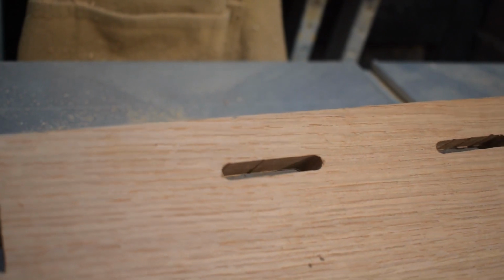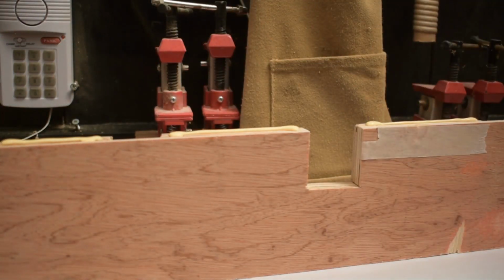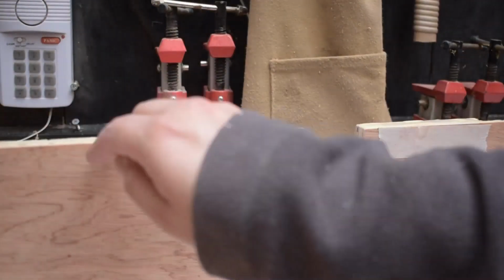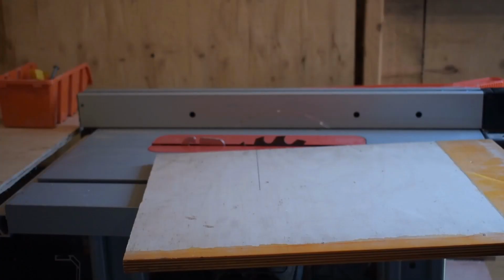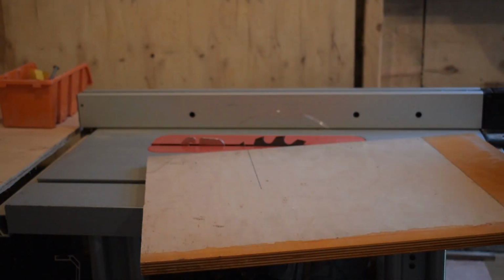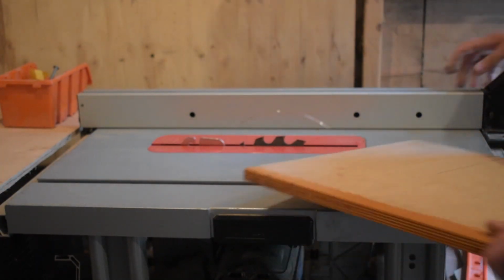The slats weren't perfect, but I just need it so that they can slide along and they'll work fine and won't be seen. And then I just glued the fence together. And then I made 2 holes either side of the fence aligned with the T-track at the back for the fence to ride along with, so that I can lock the fence with a ring knob.